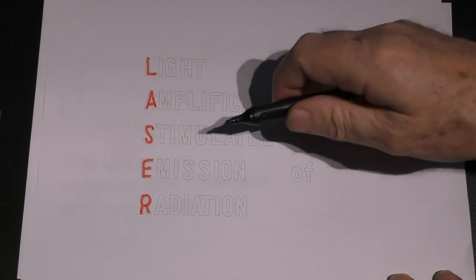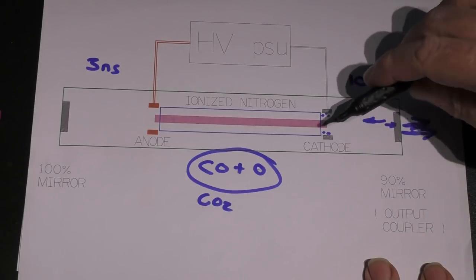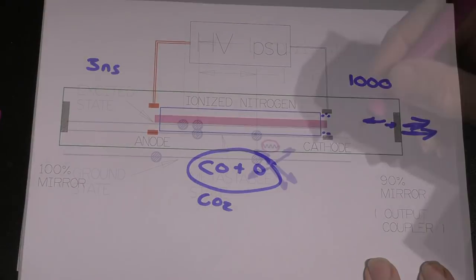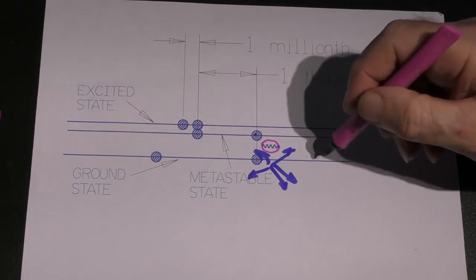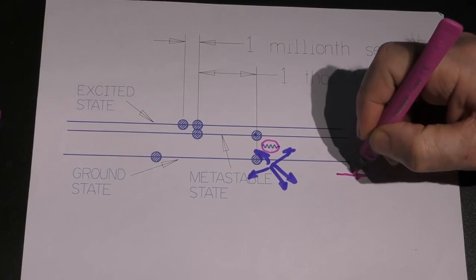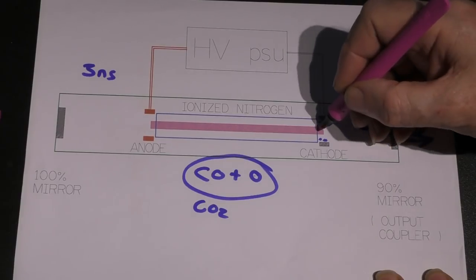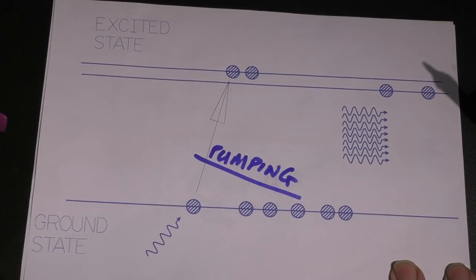Here I've got a picture of a very simplified glass tube. We've ignored the water, we've just got the electrodes, a column of ionized gas down the center, and all the other gas around the outside. But at each end of the tube we've got a mirror. There's not just one of these actions taking place — we've got millions of actions at any given point in time. So just by chance, one of these photons will end up traveling in the direction of a mirror. As it hits that mirror it's going to bounce back and pass through the tube to the other end, where it bounces off that mirror and comes back.